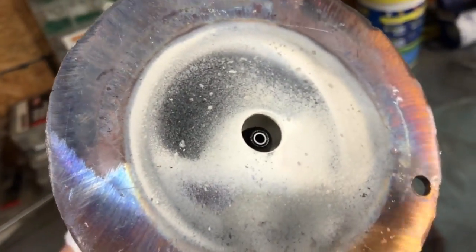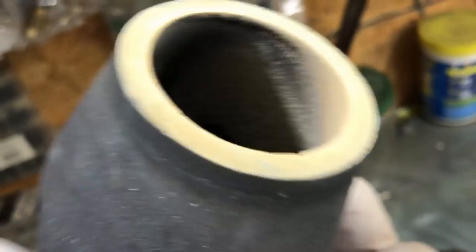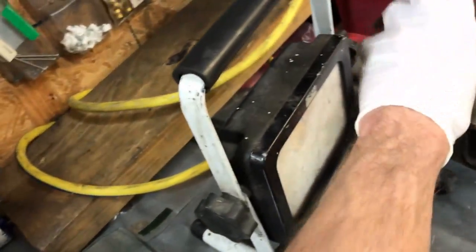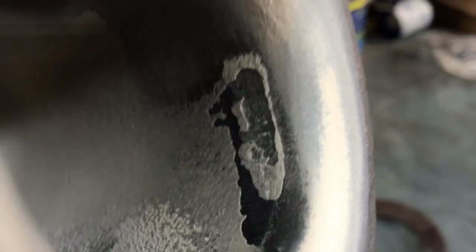Here's the back plate. One thing I do like about this small layer of build-up is it definitely ends all question of the possibility of carcinogenic particles emanating from this thing — they're completely buried in soot. This is kind of what it looks like inside one of the Godzilla burners as well. But even running at almost white-hot temperatures, you still will get a small layer of build-up. It just burns away after a while and won't get any bigger than that. See how it's flaking off there — you just have to make sure you run this at red hot and that your nozzle is aligned perfectly.